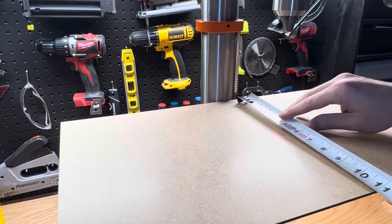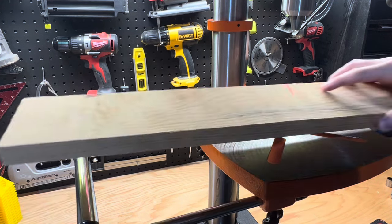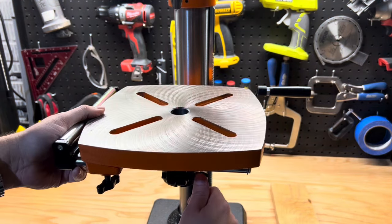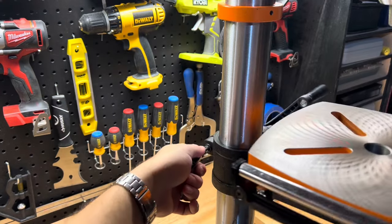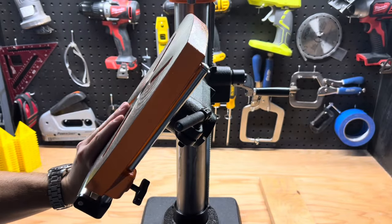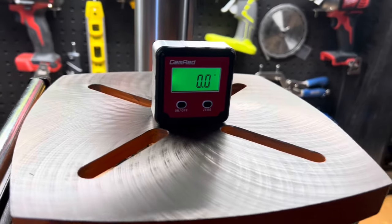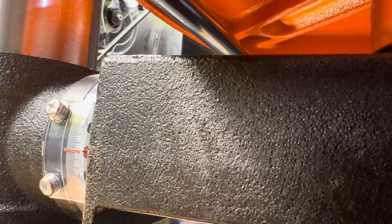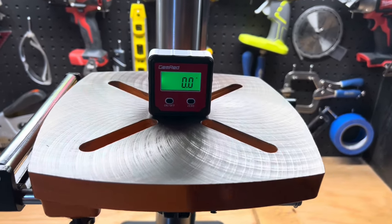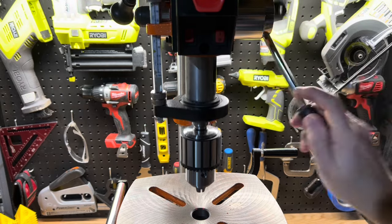This is a 12-inch swing tabletop drill press, allowing you to drill the center of a 12-inch workpiece. The table can be extended to accommodate longer workpieces and rotated to any position needed — rotated around the column, raised or lowered, as well as tilted 45 degrees in either direction by loosening the screw underneath. I use a digital angle finder to ensure it zeros to align with the gauge, and I'll provide a link below. The spindle has a travel depth of 3-1/8 inches, allowing plenty of room for all of my DIY projects.